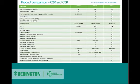On hot-swappable and dual power supply features, the 2960X has no support for the dual power supply, but the current 3750X does, and the new 3850 also supports the dual power supply and fan modules. For stack power, the 2960X series doesn't support it. Only the 3750 and 3850 support stack power. And stateful switchover is only supported on the 3850.